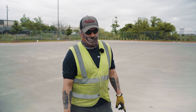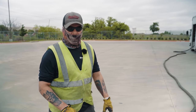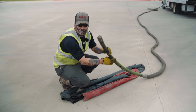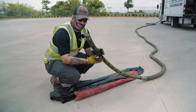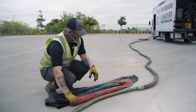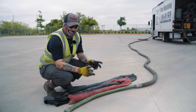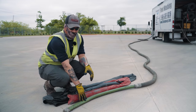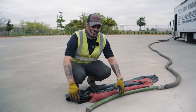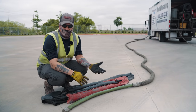Another thing: while you're doing wash water recovery, if you're getting a lot of debris coming towards your vacuum and your sandbags, always try to keep this area free of any debris, because once these holes get clogged up with trash, sticks, or whatever it is, the filter inside the truck is going to get clogged up, and once that happens the vacuum is not going to suck up water the way it's supposed to, and all your dirty water is going to pass and go down into the storm ditch.